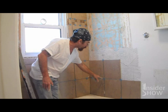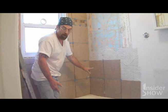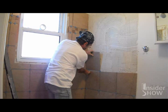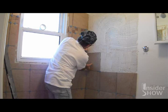Your spacers — the hard spacers — keep tiles from sliding down so you maintain the same grout line all the way around. Pop a spacer in, get a second spacer ready, drop it down, get the other spacer out of the way from that wall, and make sure you've got a good press.